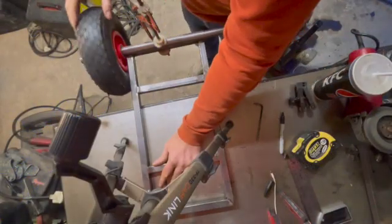So I went ahead and popped it in the lathe. I don't have a centre steady for this lathe, so there is no precision here. I went ahead and took 5mm off of each end and also cleaned the centre up a little bit.